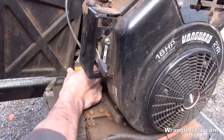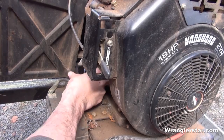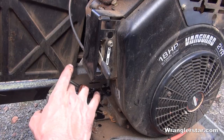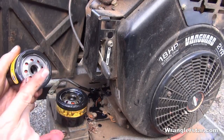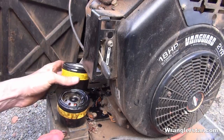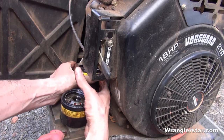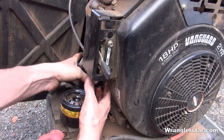This particular engine has an external oil filter, which is really nice, so I'll go ahead and change that out. With oil filters — whether it's your car or power equipment — make sure that the rubber seal on here is coated with a little bit of oil. You can use the new oil or any oil is fine. You don't need to over-tighten oil filters. You never want to put them on with a wrench. Usually as tight as you can get it with one hand is sufficient.